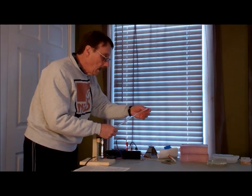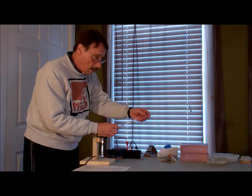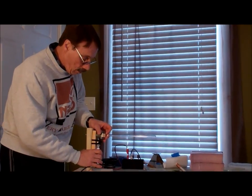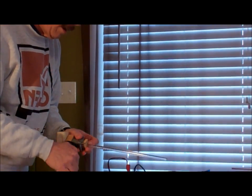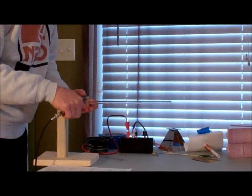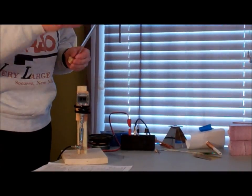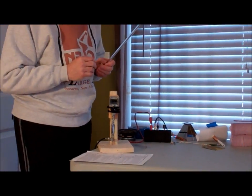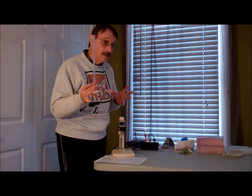But if I take this and put this little circular coil, a little helix, on the antenna and position it about there and stick this in, we get something that's almost constant around the 90 degrees. Okay? And that's a great feature of circular polarization. It can be picked up no matter where your horn is. Sometimes as the Earth turns, we're looking at things out in space, the orientation of an object will cause it to go out of linear polarization fields. So the radiation will drop off. Circular polarization, though, doesn't change in that respect.